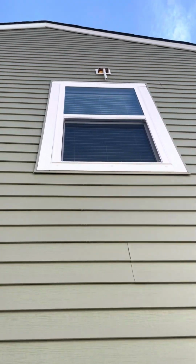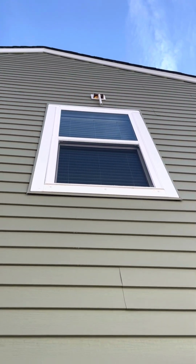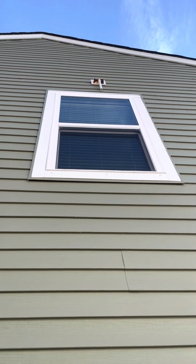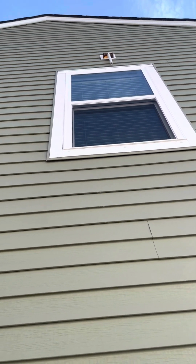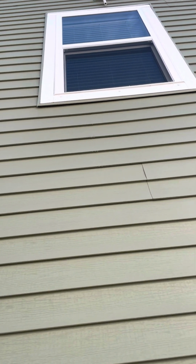And if it gets clogged, you have your secondary drain line right there. They put it over a window. If you ever see that one dripping on a nice day like this and it shouldn't be dripping, you need to call someone. That means your primary's clogged, and you don't want the primary clogged. So you'll call someone like an HVAC company. They can come out and unclog it for you.